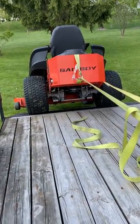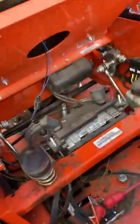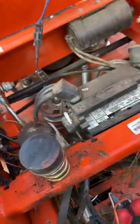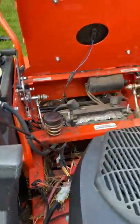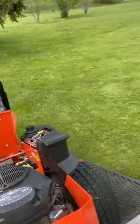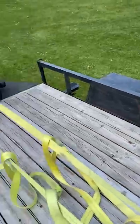Bad Boy are great tractors, but the downside is where they place the battery and the battery clamps right here. See those wing nuts? Those fall off, and right below there are these little vents where the fans and the drive pulleys for the gear drives on this zero turn operate. So when that wing nut decides to vibrate loose and that rod slips down, it interferes with the belt and pulls it off.